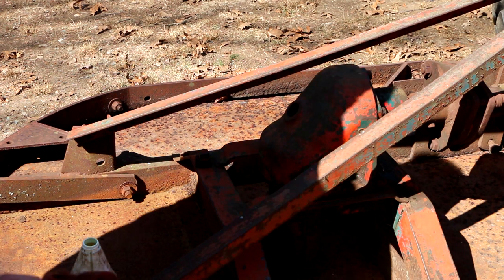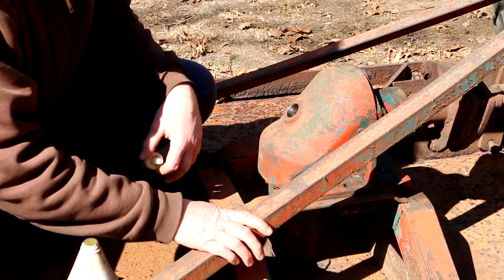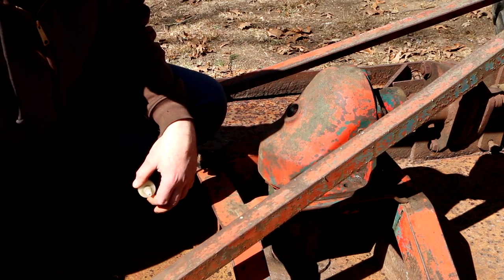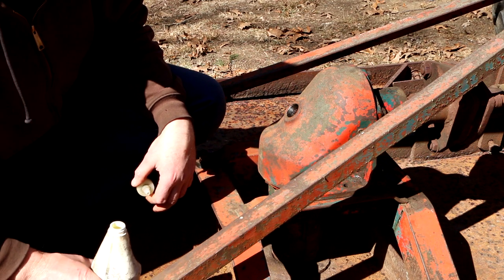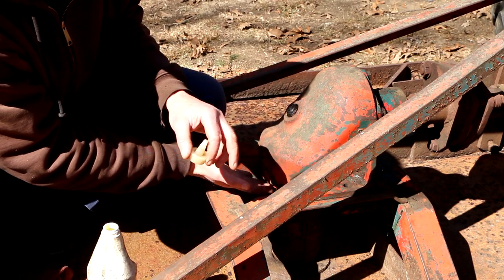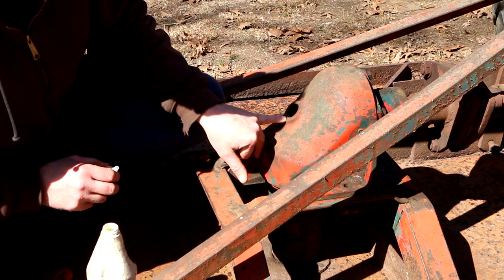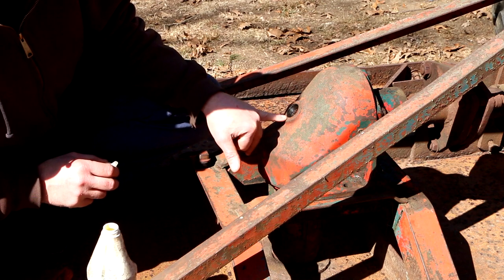Time to put oil back in the gearbox. So the owner's manual calls for 90 to 100 or whatever the heck it is gear oil, and I just put a full quart of that in and didn't fill it. The fill mark on these is to fill it up to the level right before it starts pouring back out of this fill hole right here.